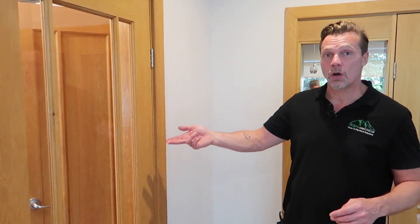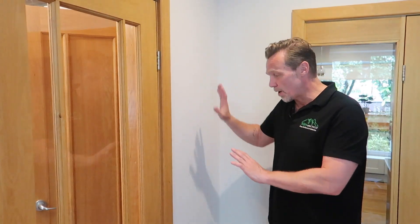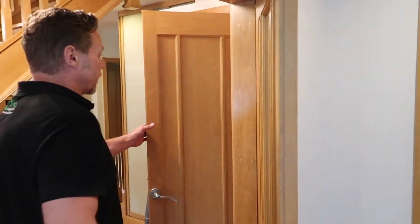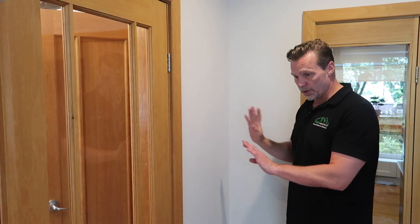We'll come and have a look inside and show you where everything's going. So this is the dining room in the house, just next to the hallway. It's a beautiful home, so I need to make this look very pretty. We're going to put the inverter and batteries here — it's literally the only option because the electric cupboard is right in here. I'll probably put the isolator on that side to keep everything as neat as possible. We're going with the Fox Cube system, which looks really smart — in here it'll probably look like some sort of hi-fi system. They're going for one master and three slaves at 2.9 kilowatt hours each, so that's a total of 11.52 kilowatt hours.